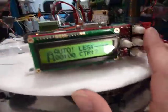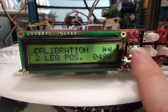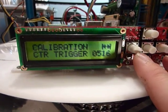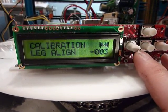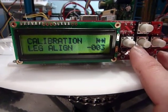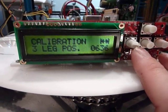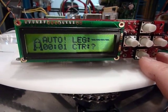One of the nice things as soon as you have electronics is you can do all kinds of nifty things. In particular, it knows what the position for the two legs is, it knows where to trigger the center leg, and it can even take the bias out of the legs since they have two different actuators. The right leg might be slightly off from the left leg and it's hard to get it mechanically perfect, but here by software you put a slight correction — there's a little minus 0.03 correction. That's the three-leg position, and all that is programmable.